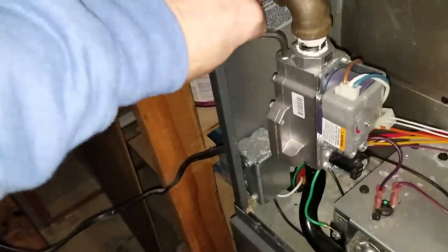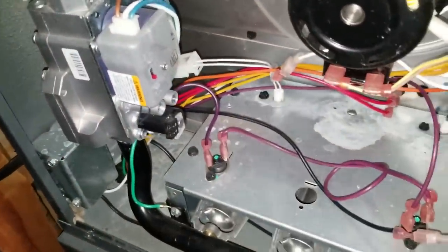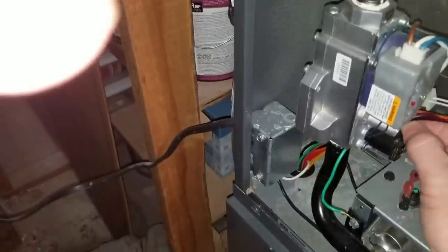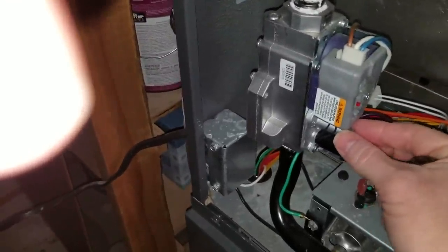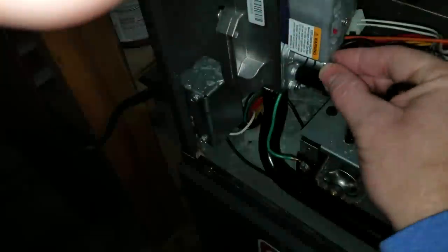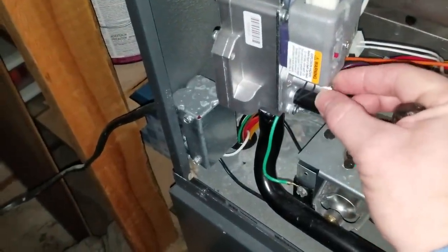Last thing, just depending on what gas brand you have, make sure you look at your installation instructions. Some instructions have you adjust the high side gas pressure first and then adjust the low. Some of them have you adjust the low first and then the high. If you don't do it in the order that they have specified, you sometimes will get gas pressures that are funky in the opposite stage. So just make sure you're following the recommendations of the manufacturer. If you have questions, you can always call your rep or the people at the supply house, and they probably can help you out maybe.